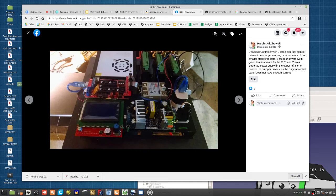So it's very convenient, just an easy way to turn on a bunch of stuff. That's why we call this the universal control, because you can have multiple inputs and outputs through the same thing that already controls the printer, and the already built-in ability to control stepper motors and larger stepper motors. So it's like, what else do you need? You need inputs. You need to control things as signals through outputs that you can run through power handling elements like transistors or solid state relays or mechanical relays. So, yeah, that's all we need.